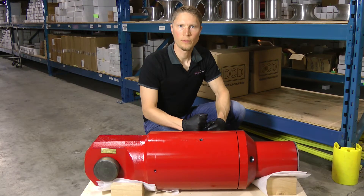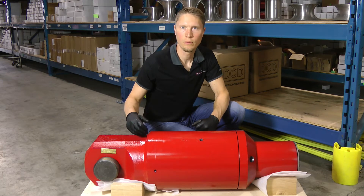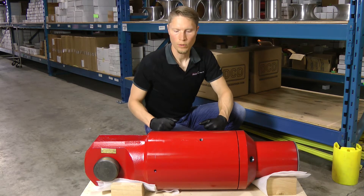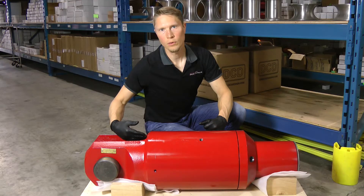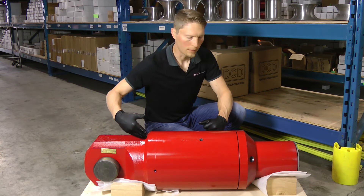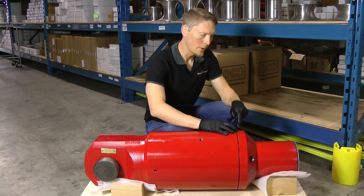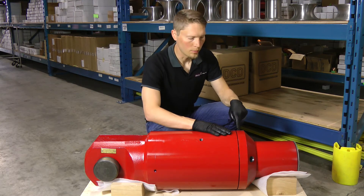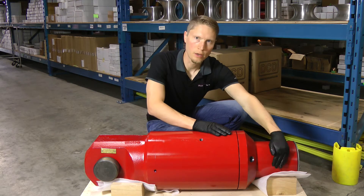For a Maxi Dub swivel, the best place to start is with your operator's manual. It'll give you your serial number, the locations of the grease zerk, and the grease relief valve. I'll walk through the example for a 220 ton. Your grease zerk is going to be located on the fixed end between the clevis ears. On this, we have the mounting holes for eye bolts, and there are pipe plugs here that go between the seal cover and the shaft, located on either side.